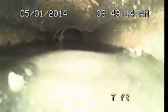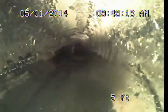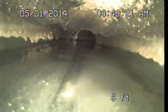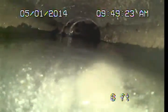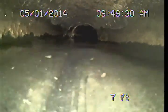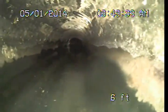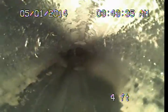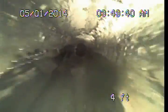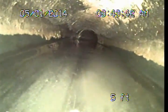Now the minimum slope requirement for a sewer line system is 1/4 inch of fall per foot of pipe run, so that everything drains out completely. You know, if it was a 1/2 inch of water or something like that, because of the plastic's smooth inner surface, I probably wouldn't make a big deal, but this pipe's at least half full of water through this 2 to 3 foot section, so it has a much higher potential to collect debris and create blockages. So I'm going to mark this area out. I'm going to suggest a repair here.